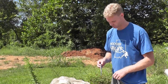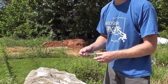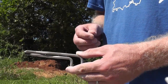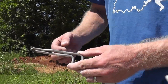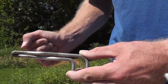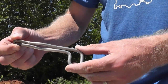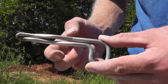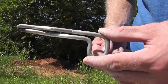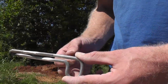We have a lot of surface area here, a lot of big angles where the glue really hardens around that and truly holds the bolt in place — especially for a straight-out pull, it has tremendous resistance. The second key feature of the wave bolt that makes it truly unique among any other glue-in bolt is this little gap between the two rods. This is a half inch bolt at this end — it is a true half inch — but it tapers out a little wider, and at the other end it's approximately 0.6 inches, about a tenth of an inch larger.